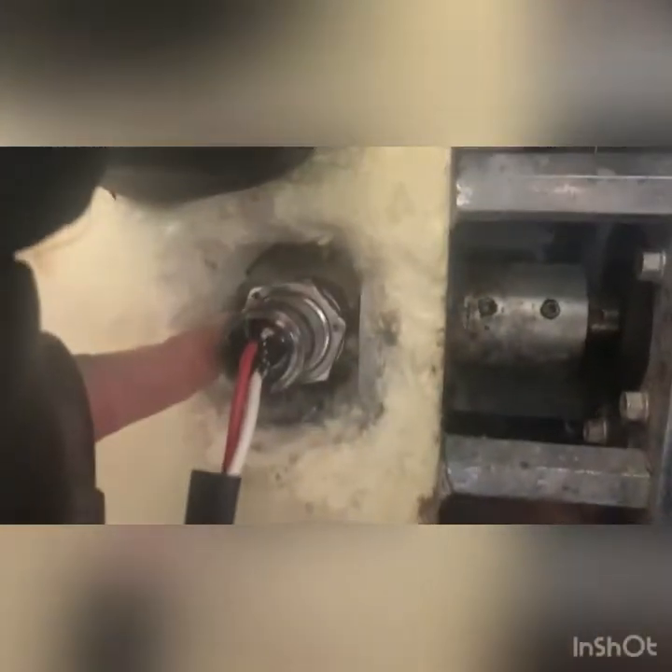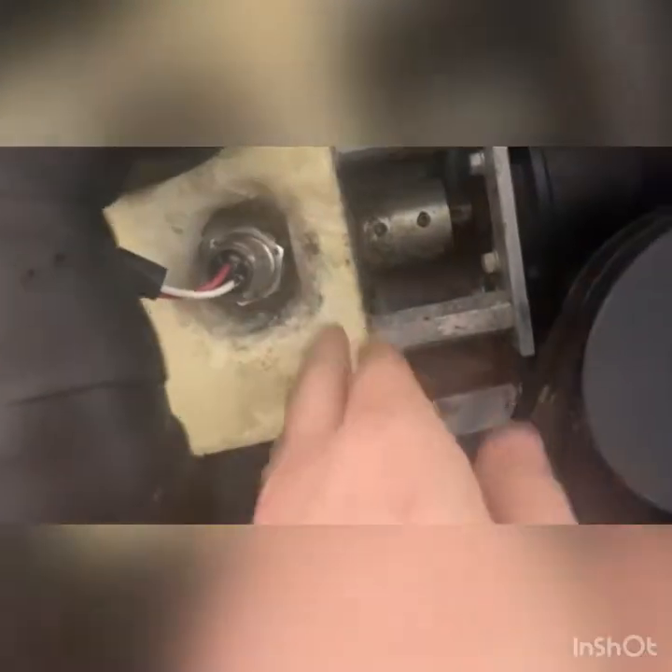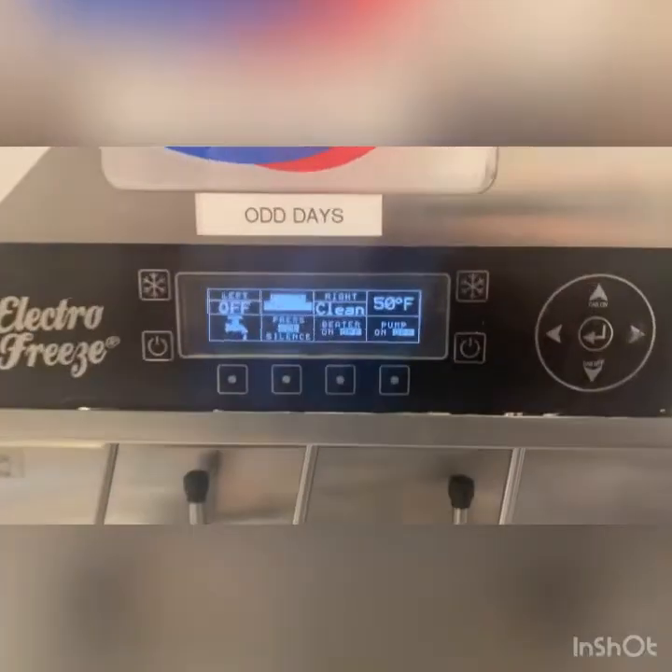I reached my arm in and was able to put my thumbnail behind that front plate, so we knew it wasn't seated all the way. John continued to tighten the nut — he made sure the inside bearing didn't spin — and he tightened and tightened until my nail wouldn't fit behind it anymore. We're just going to let the silicone harden up. These wires need to be reconnected and then we'll zip tie everything together so nothing can get pulled into the pulley.